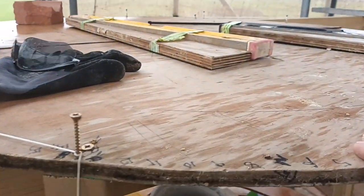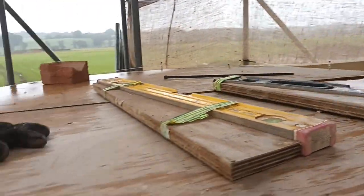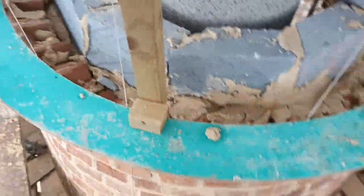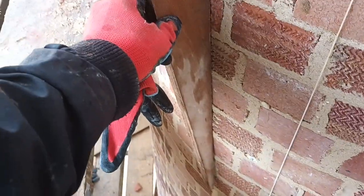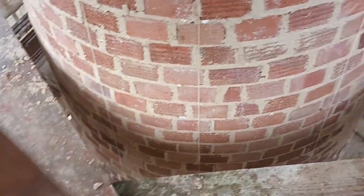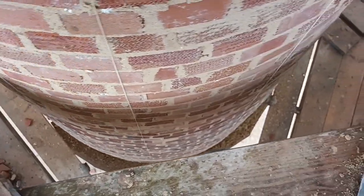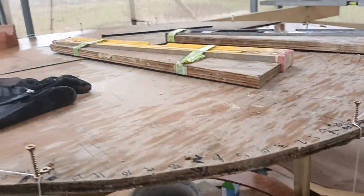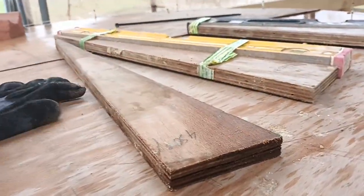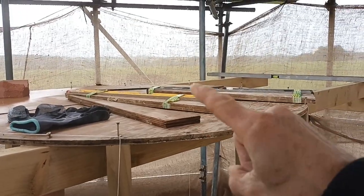Everything's tapered — we have our taper boards fixed to the little levels. Further down the lines are further apart, and those are just an intermediate to put on the walls to keep plumb. As we've come up, the lines are so close together you don't really need them — you can just work between the lines. Further down we use the batter boards on our 600 levels to save any lumps and bumps.